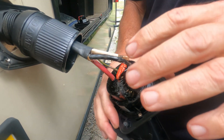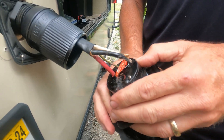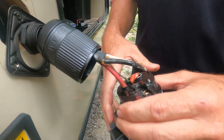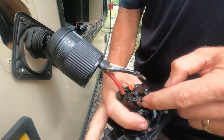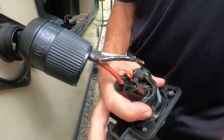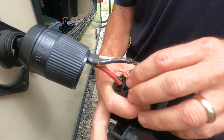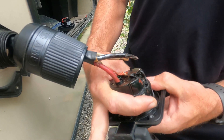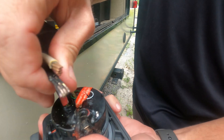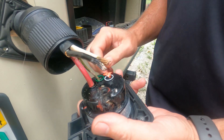This is how it came from the factory — I have not taken any of these screws loose, and these wires just pulled right out. So that in itself is probably why this got really hot. Loose connections will cause extra resistance, which is going to build up heat and cause this. The fact that this was actually even powering up the RV is pretty amazing.